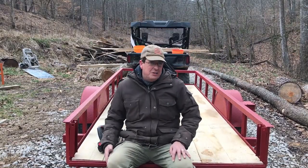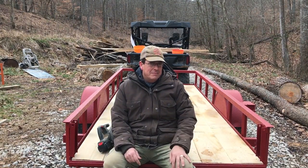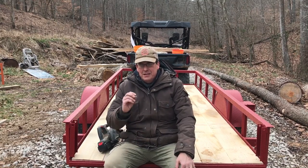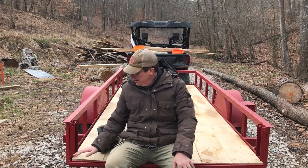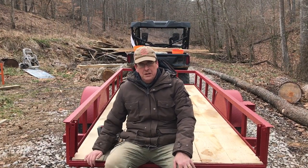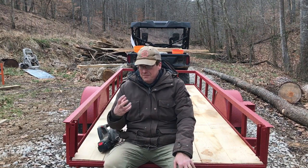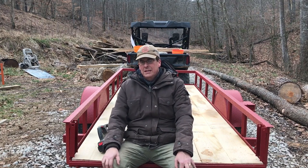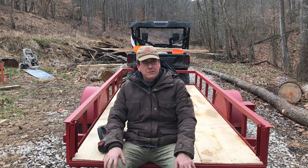And what I've decided to do with finish, looking at that polyurethane stain that I got out last night, it's already started to kick a little bit. It's crystallized, so we're not gonna use that. We're gonna go old school, reclaimed oil, recycled oil, and just oil this. That way it soaks all the way through. I get a nice complete permeated board with oil, and that'll keep obviously the bugs out of it and keep the weather from rotting it out.